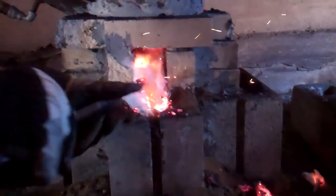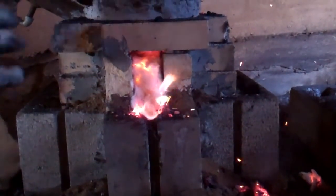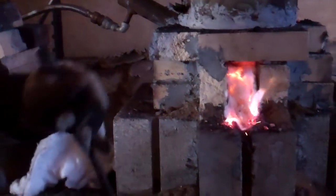So you're talking about the slag, you want that to flow off. So at the end of this, you're going to end up with like a ball of steel? Yeah, kind of. If it's forming well, it'll be like a big bird's nest shaped blob with a depression in the center. So the slag forms on top of the steel because it's theoretically on top of the bloom.